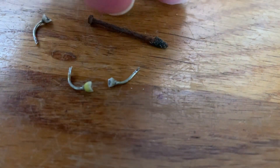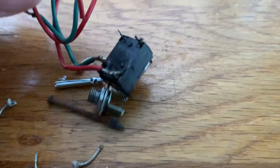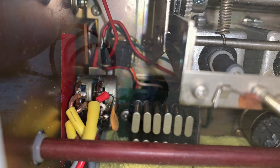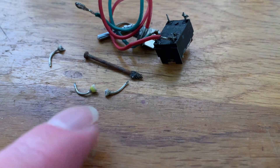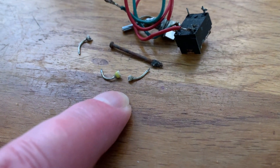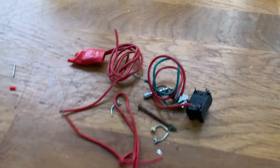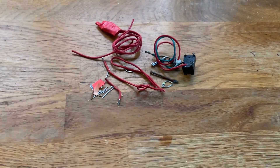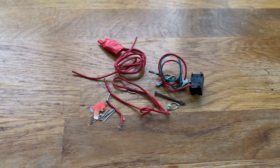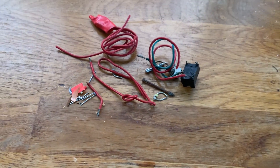There was a switch on the back which was part of a mod and had broken. This switch supplied a relay which basically shorted, and that's what popped the diodes. I've replaced the diodes with some 1N4004s and re-soldered them into the board. I removed all of the mod components — that's all the spoils from the rectifier board and also from the crystal board. It's all been taken out and put back to, hopefully, factory defaults now. Let's see if it works.